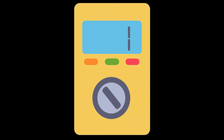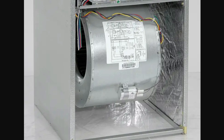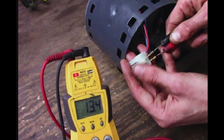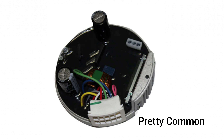Another possible reason is that you have a permanent split capacitor motor — you can tell because there will be a capacitor mounted to the side of it. Turn your power off, disconnect the wires, discharge the capacitor by running a screwdriver across the terminals, then perform a microfarad test. These capacitors usually have a data label on the side that tells you the tolerance, so you can tell whether the capacitor is good or bad. You can also have an ECM motor — verify you're getting high voltage to the motor and a low voltage communication signal, which can lead you to a problem with the control board, the control module on the blower, or the blower itself.